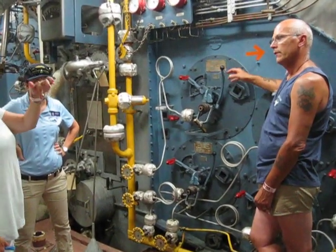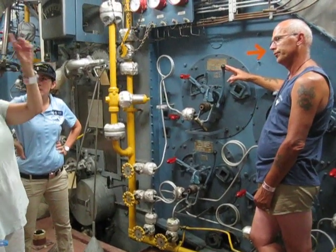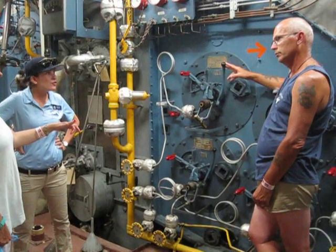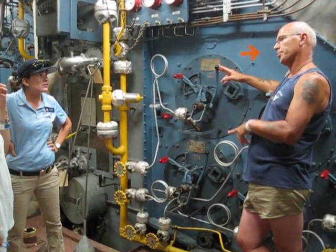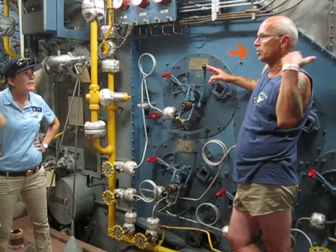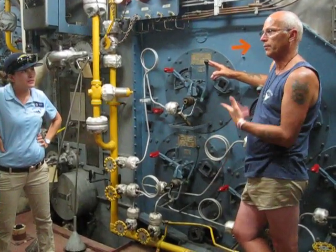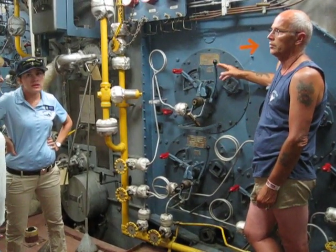We came down a flight of steps from Broadway. Would something on Broadway control down here? Just for emergencies. When you evacuated your space, you went up into Broadway and that's where you shut your boiler down. There was enough up there — like your fuel oil trips, your main steam stop, closing valves, your eductor system to suck the fuel out. But that was really the only thing you did up on Broadway, and that was just in case of an emergency.